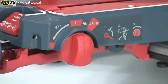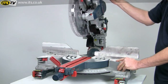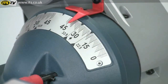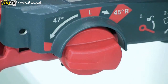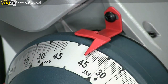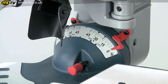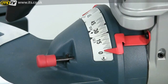The knob on the right of the pivot arm controls which way you can tilt the head. A clear scale shows you exactly what angle is set. Selecting max range on the knob allows you to over-cut the angle up to 47 degrees either to the left or to the right. An automatic reset plunger locates everything back at 90 degrees, and there's also a detent stop at 22 and a half degrees.